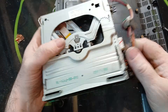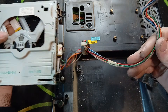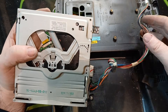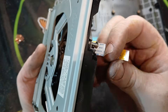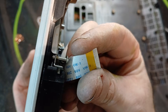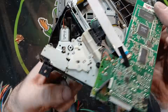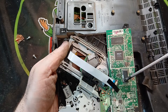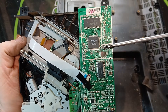As well as the bits of gold, we also have some wire that can be put in with your insulated copper wire — just trim off any bit ends and check with your scrapyard how they want it. I also quickly check the ribbon wire: this one is nickel-plated, so it's not actually gold and not really worth treating. On this board I'll take off the chips for gold recovery and any MLCCs that are a fairly decent size.